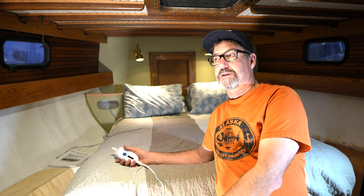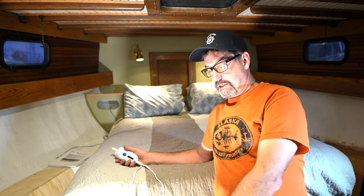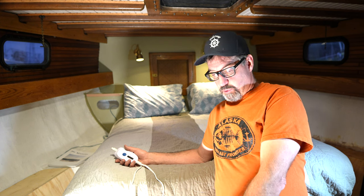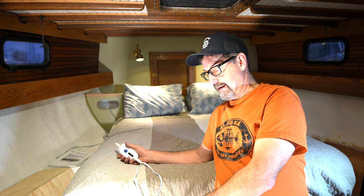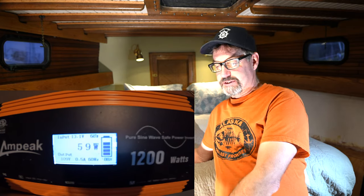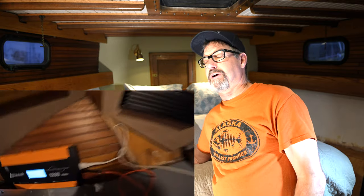We've got the battery sitting here — it's 160 amp hours, 12 volts, whatever that works out to, a couple kilowatts almost. We had a little cheap inverter, a little modified wave, but this electric blanket will not run on that apparently. So we got a pure sine wave — just a small 1200-watt unit for the experiments. We use this as a portable battery bank; we can take it in Art's van or wherever. It works fabulous.